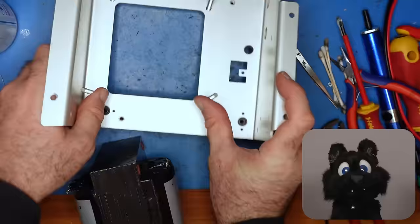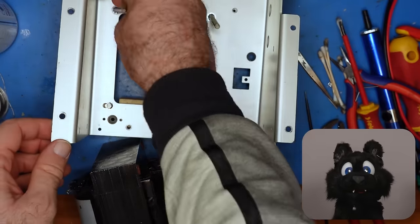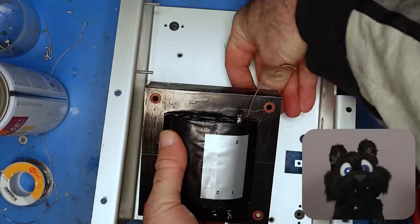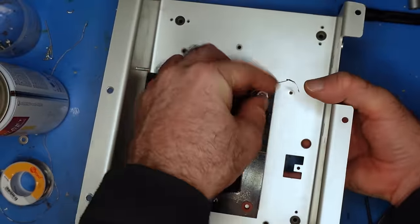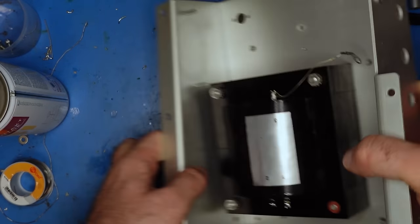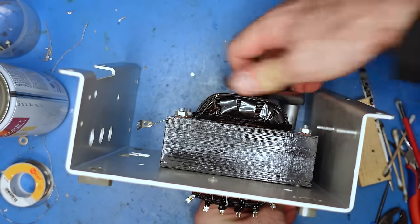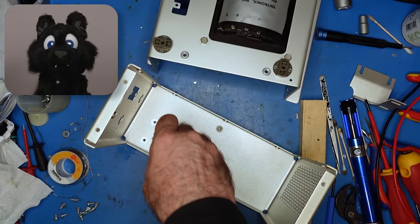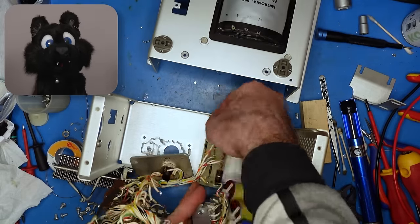And now, assembly time! Let's start with the collector supply. It is pretty much a self-contained unit anyhow, so it's a good way to get parts off the table again. On the side there's two rectifiers. One is for the 1500 volt range, the other one is for the lower ranges.